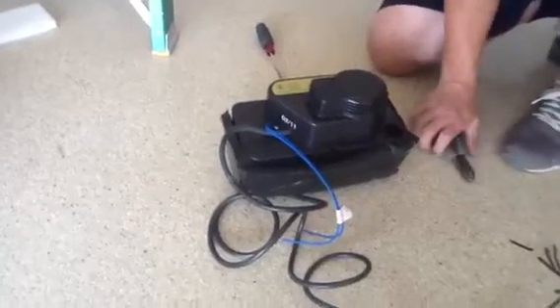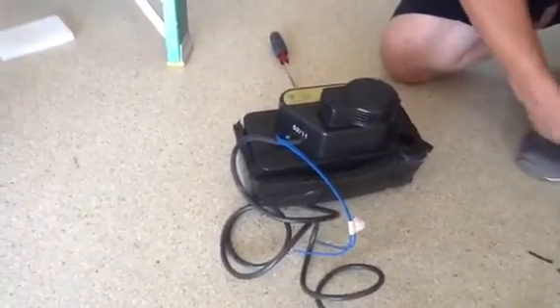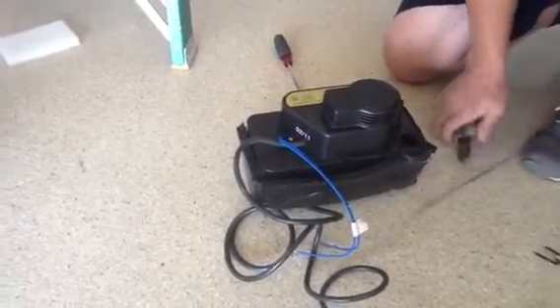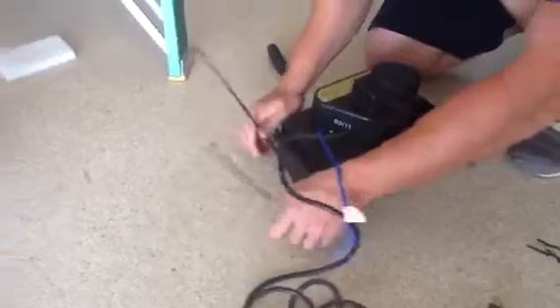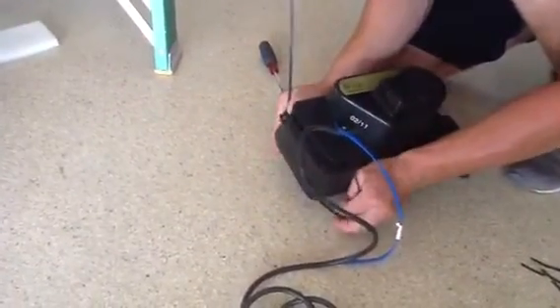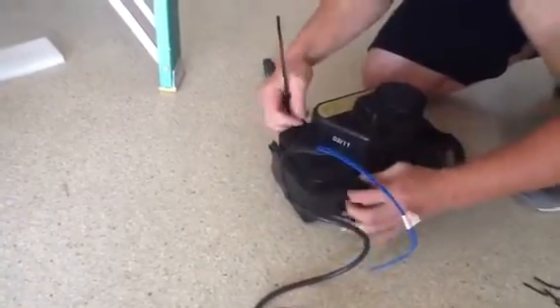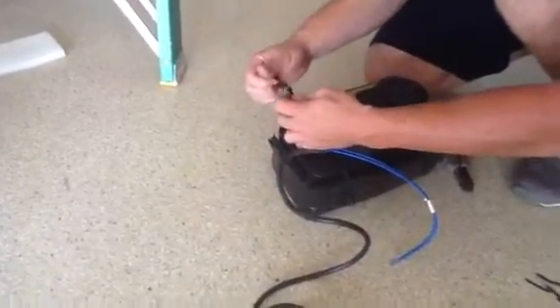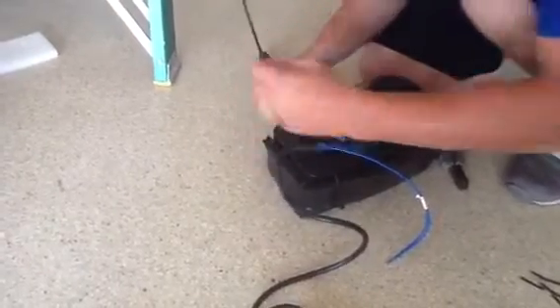Some of the benefits of these condensate pumps are they have increased pump cycle, resulting in less frequent pump operation. In other words, the unit pumps fairly frequently in order to not block the condensation, so the sludge will not build up into the condensate pump. Those two blue wires you see are another float switch that we tie in with the air handler.